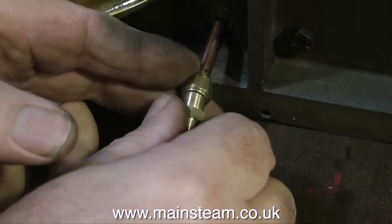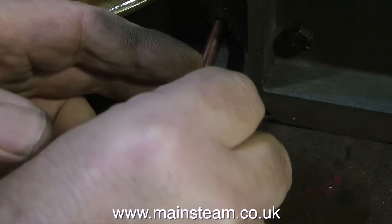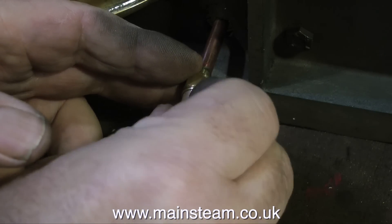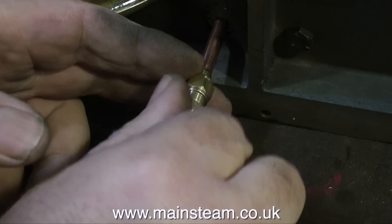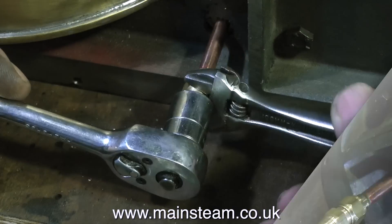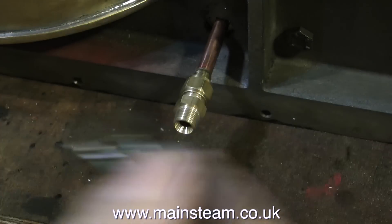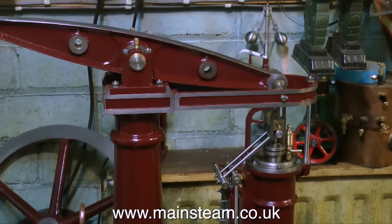I'm using a commercial double union to connect the outlet from the pump to the inlet to the flexible pipe system. When I finally get the thread to engage — that's more like it. Many times when I've done jobs like this I've forgotten to tighten the union, just left it accidentally finger tight. And I certainly don't want to do this inside the engine, so I'm making sure it's tight.